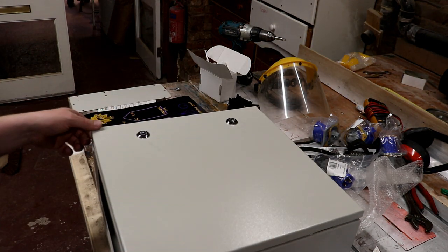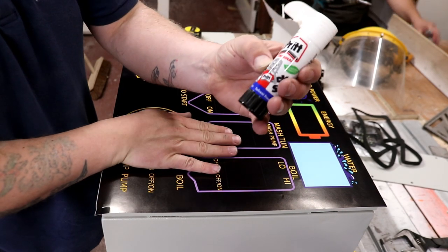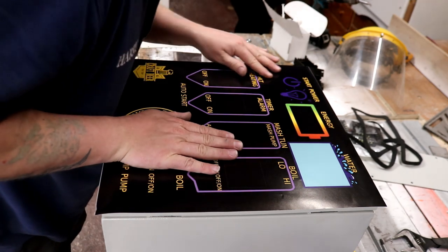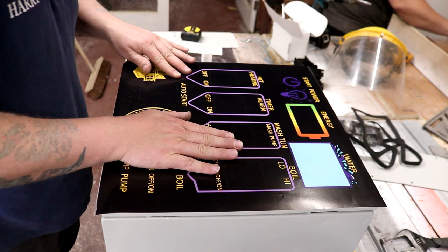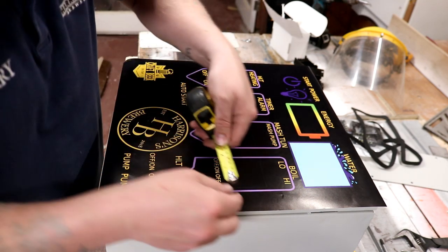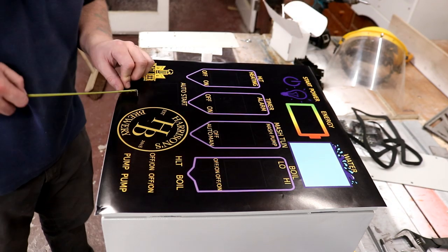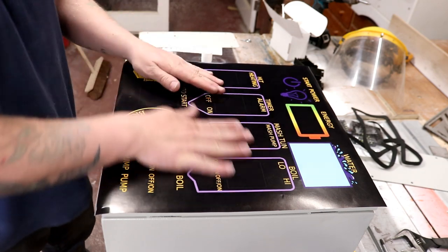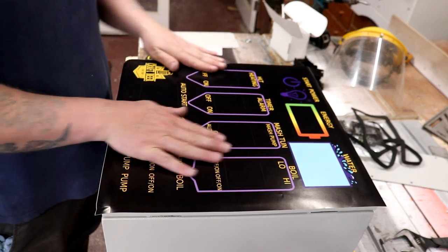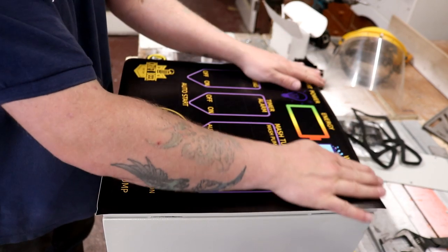So thank you very much Shaz and Chris and Ashley and the rest of the gang. I've put some Pritt stick on the panel - which we can clean off with solvent cleaner afterwards - and I can see a couple of the holes are actually in the wrong place, but provided we're within 30 mil of the sides for these edges, and we are - 30 mil of the top easily, 30 mil of the bottom spot on - everything's going to fit. Whether the key holes are in the right place doesn't really matter much; what matters is all the components will fit in there nicely, and that is looking pretty spot-on.